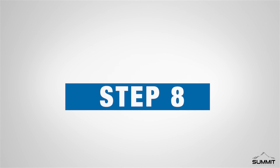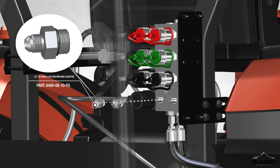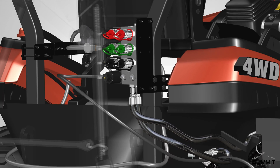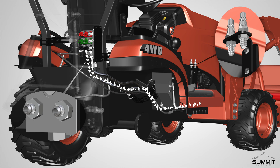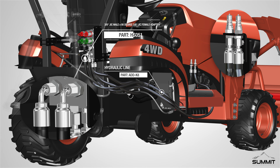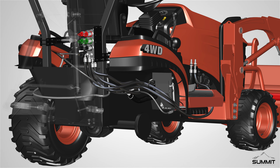Step 8, Third Function Hose Installation. Begin by installing two three-eighths inch JIC male by number 8 SAE/ORB male onto the valve manifold P and T ports. Fully tighten as needed using an adjustable wrench. Route the two hoses with three-eighths inch JIC male 90-degree adapters and three-eighths inch JIC female adapters underneath the tractor. Be sure to follow the steel line and route away from the wheels. Install two three-eighths inch JIC male by 90-degree three-eighths inch JIC female adapters onto the two three-eighths inch JIC male by number 8 SAE/ORB male adapters on the manifold. Continue to route the female adapters towards the mid-mount bracket. Connect the two three-eighths inch JIC female adapters to the mid-mount bracket with two three-eighths inch JIC male by three-eighths inch JIC bulkheads. Fully tighten both hoses and tighten the hardware using an open-end wrench. Step 8 is now complete.